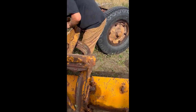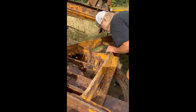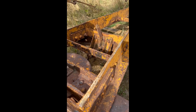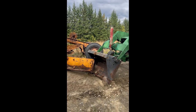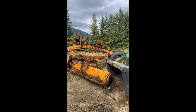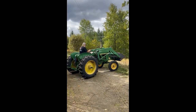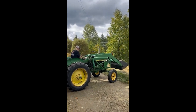These are just part of the joys of working with this old iron — nothing goes easy. I finally figured out that if I just tap that pin back it'll tilt on the circle. This grader never did have a gear-operated circle; it was just a pin with a bunch of pin placements that it would fall into to capture it at a certain angle for your grading project.